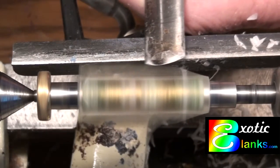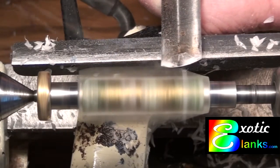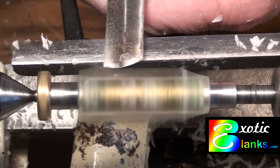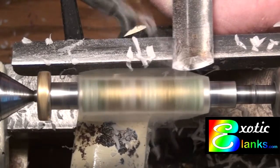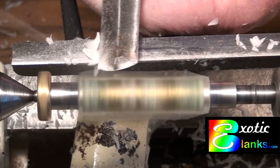This is very easy material to turn. It's just a matter of taking off the ends — don't bite too much as you go across. As you can see, I'm staying fairly far away from the actual blank. I'm just taking off those two corners.